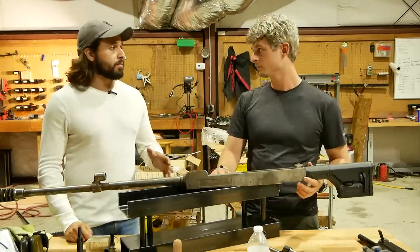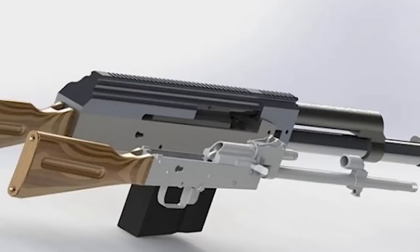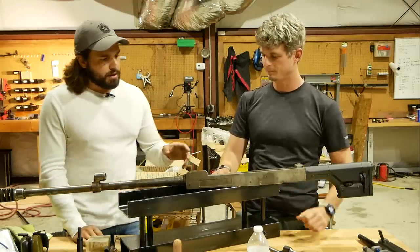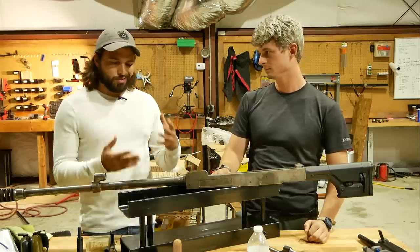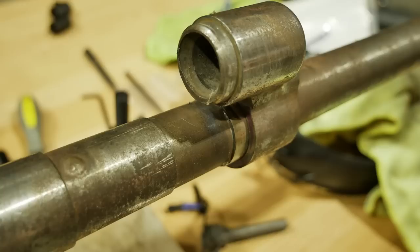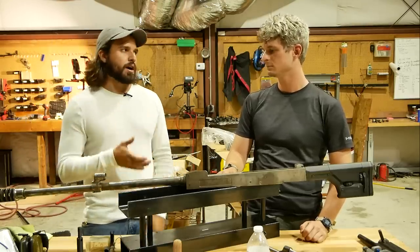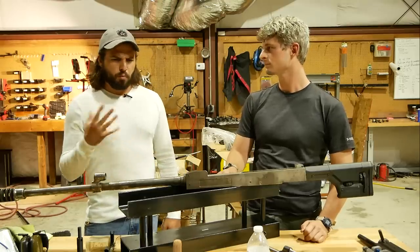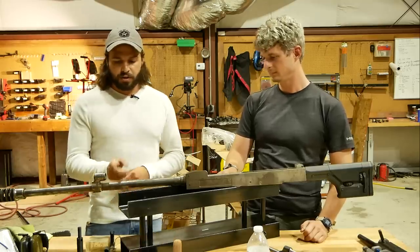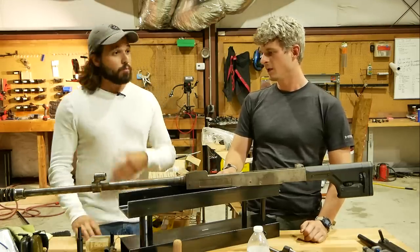I didn't even know how to do CAD when we started. I had to hire people for that, and I wasn't working with gun guys — just CAD guys — figuring it out as we went. The prototyping was very expensive early on; we hadn't figured out the lean prototyping approach. We had our gas port drilled far too close to the chamber, so the unlock pressure was super high. Our extractor was ripping through casing rims, and even when it wasn't inducing failure, you could tell it was extracting under too much pressure. We had to move the gas port forward and it ran a lot smoother after that.